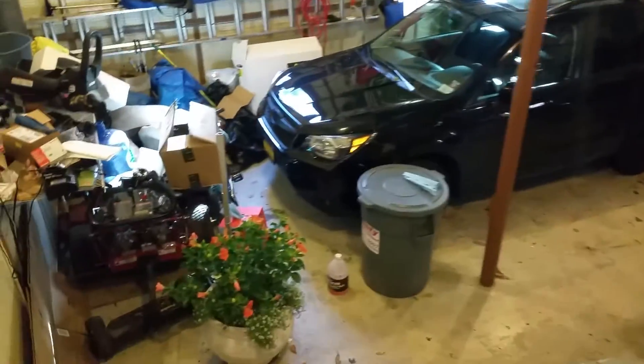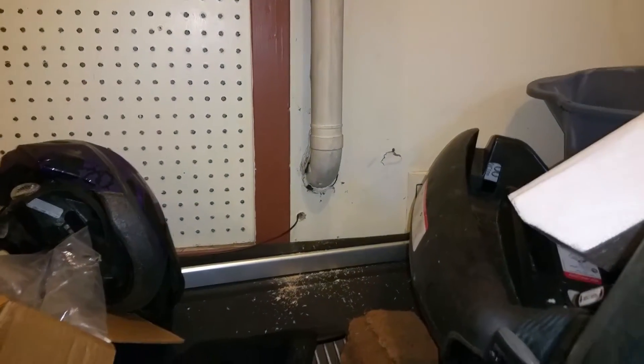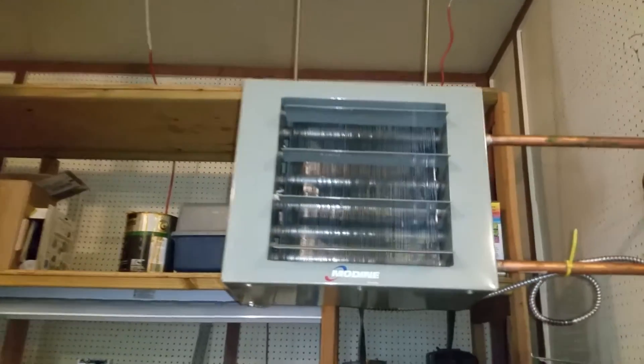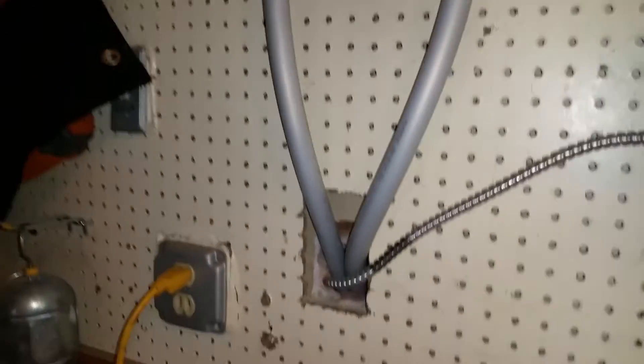So in the garage here, I put a thermostat over here, which I obviously have to tidy up. I found a place where the central vacuum came out — I just ran a wire right next to it, right through. Wasn't too difficult. And then I mounted the Modine heater up on threaded rods, as the instructions say to do. I did copper just as far as here, which is over to the PEX that goes through the wall.